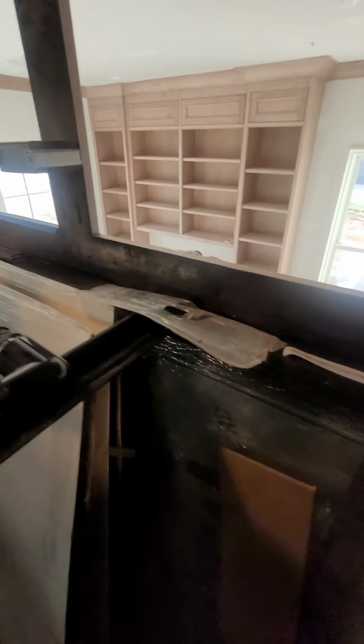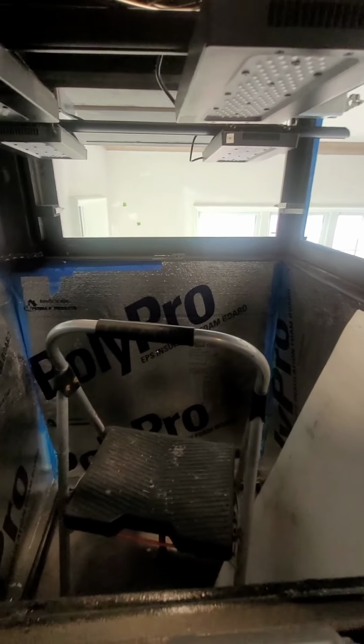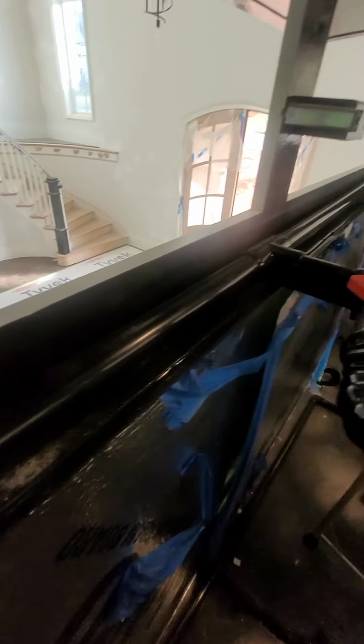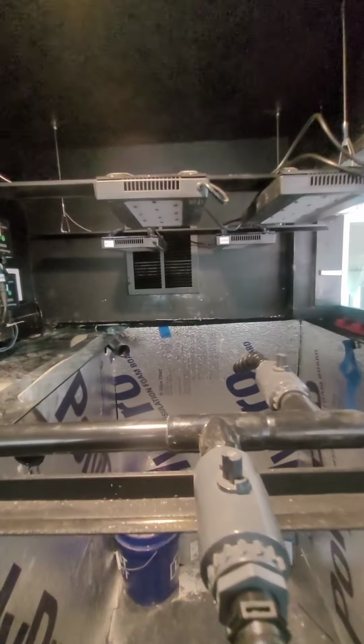We wanted to make sure that this thing was sealed up very nice and properly, so there is a bead of silicone that goes around this whole entire rim of the tank, so no salt creep can get in between the upper portion of the tank and the cabinetry on the outside. We also line this whole entire upper portion in some rubber. That way the exposed wood or drywall won't absorb any of this excess moisture that could happen over time.